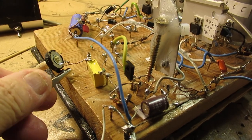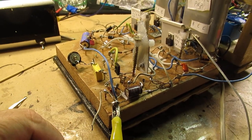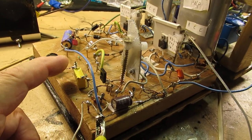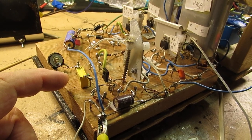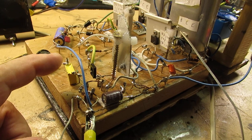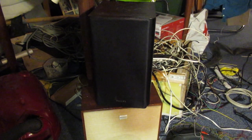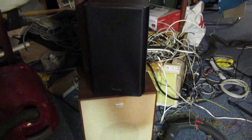Let me show that. So this is the normal sound that you hear with your homebrew amplifier when there is no input at the separation capacitor of that first transistor here. So you can surely hear a lot of hum because the input is completely open. Say it is perhaps in a 1 megaohm range. I don't know that. Perhaps 10 megaohm.